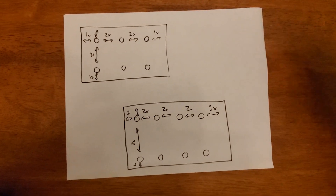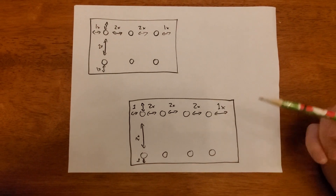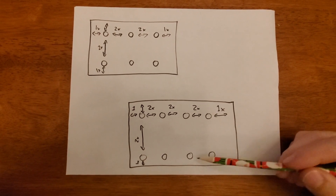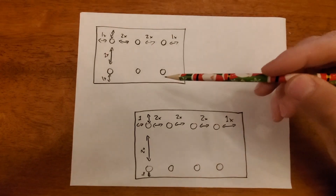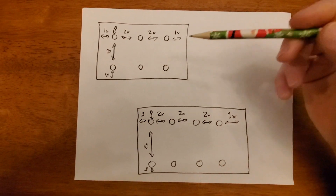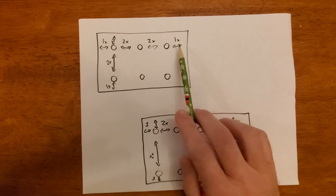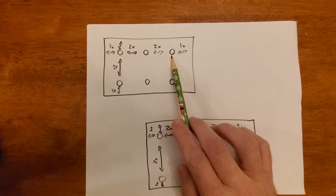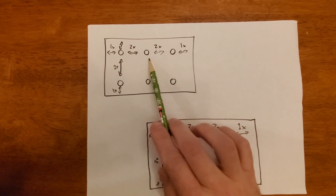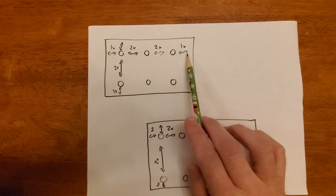Here are a couple of diagrams that will hopefully help you to lay out your pot lights. We already had ours drilled in the video, but here's a layout of eight pot lights, and up here we've got six. A general rule of thumb: if you've got your one-time spacing here — whatever this wall is to the center of your first pot light — the measurement between the next pots should be double, or two times this measurement.